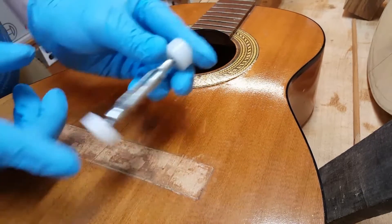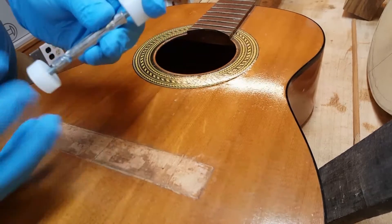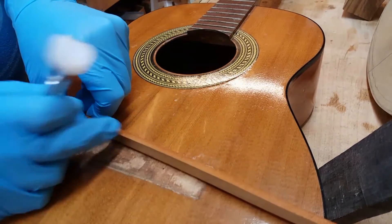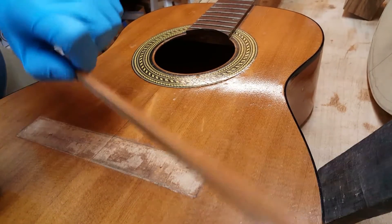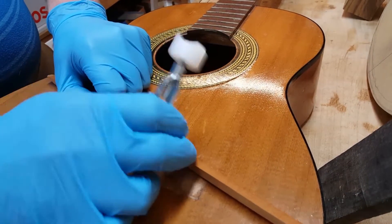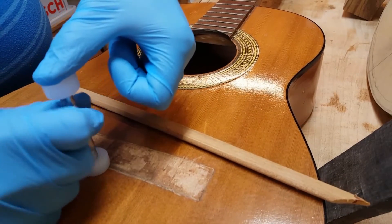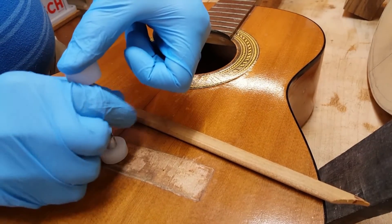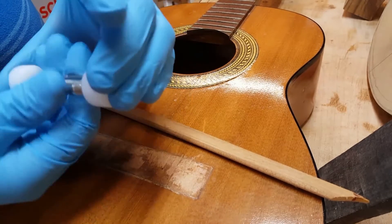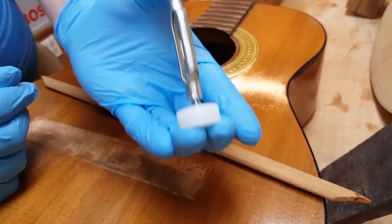You can even build this at the hardware store, but getting ends that are nice and square can be a pain, and these really aren't that expensive anyway. Basically, you just put it in there, get some glue on your brace where you need it. Here's one of the braces that actually came out of this guitar. You just get some glue on your brace — one coat is probably enough since it's hard to get in there. As you turn it one direction or the other, it's going to separate and pull apart, giving you a little bit of pressure.